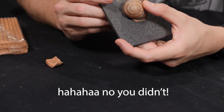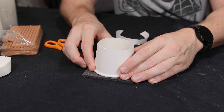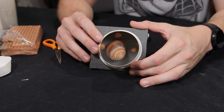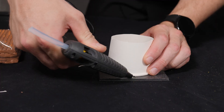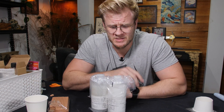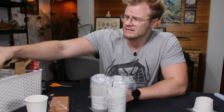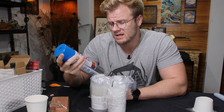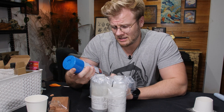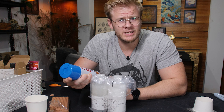I think I just about nailed that on the first attempt. Next up we're going to need a cup — cut it down so it's a little bit taller than your actual model, giving plenty of space inside for the silicone to grab hold. We want a nice watertight seal around the edge, and for that we're going to be using hot glue. This has come together quite nicely for a base, but now for the part that really terrifies me — the actual pouring of the rubber. We're going to mix this stuff up in two equal parts, and spray with a silicone surface spray to make sure nothing sticks to our model.